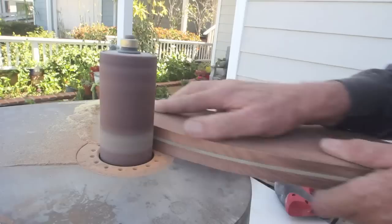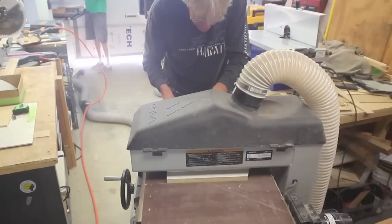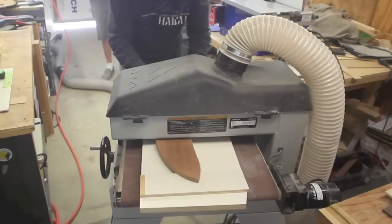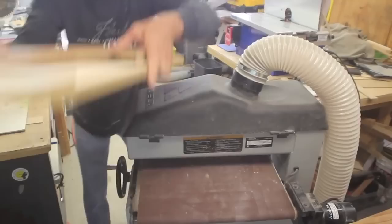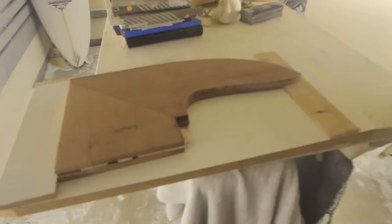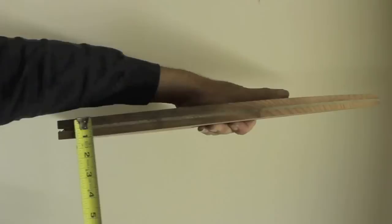I wanted to taper and foil this so it had a 1-inch base and just over a 1/4-inch tip. So I made this sled. It's a tapering jig that runs through a surface sander. Here's a look at the sled. The block on one side is twice as high as on the other. There's the taper with room for foiling.